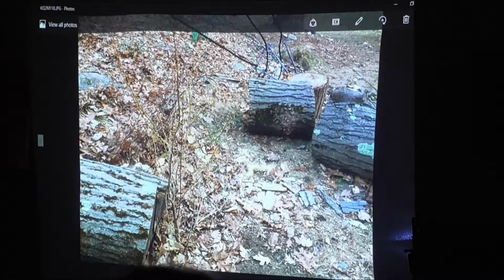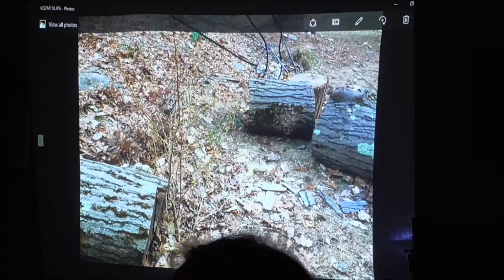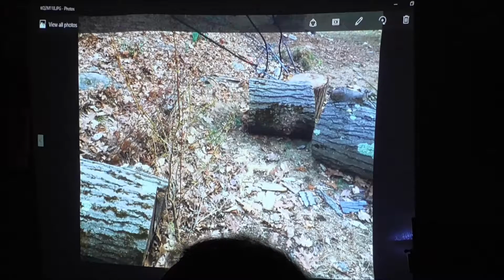But it does matter, because a play of a couple of inches, when you get a bad storm, you're now allowing the tower to sweep and twist much more, which can do a lot of damage and create a lot of fatigue over time. And nothing can withstand the jerk. And the slack will allow a jerk to occur.